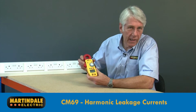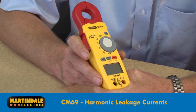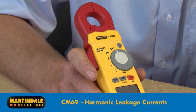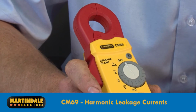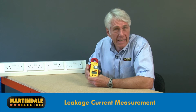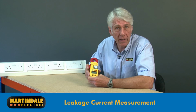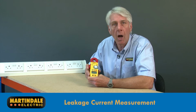The CM69 is unique in having both true RMS measurement and a switchable 50 Hz filter, making it ideal for both checking leakage current due to insulation breakdown at 50 Hz and leakage current at higher frequencies generated by modern electronics in lighting systems and power supplies. So we've seen how handy an earth leakage clamp meter such as the CM69 can be for fault finding the cause of unwanted RCD tripping and locating troublesome harmonic currents.